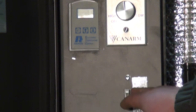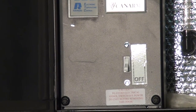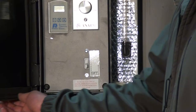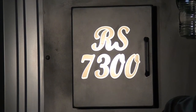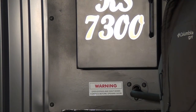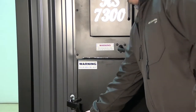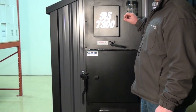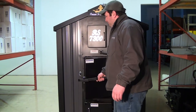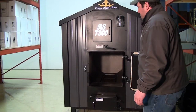When you come out to this furnace, the furnace is going to be on. Go ahead and shut this off — it's going to kick on this globe light for night filling. Go ahead and shut the control panel door. Pull the damper bypass until it stops. Crack the firebox door and let it exhaust the smoke and particulate matter up through the chimney, so when you open the combustion door you get very, very little smoke coming out of the firebox.